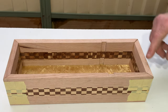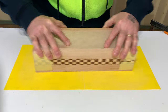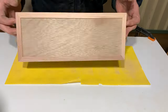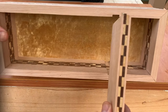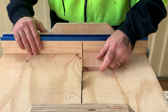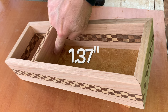There's a 1mm discrepancy between the corners. Unfortunately, I don't have access to a hand plane, so I'll use the old sandpaper method. I'll now mark and cut to suit the inside panel. Perfect. I'll now bore a 35mm hole where X marks the spot.